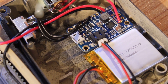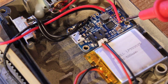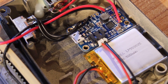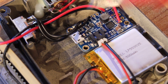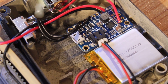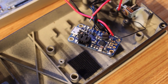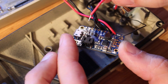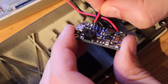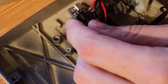We made a slight mistake — not unexpected. I hooked the barrel jack up to the plus pin over here because this is a header for USB, and I thought this was the USB in to charge it. But nope, that's the USB power out. The USB in to charge it is the micro USB on the left side, which makes it a lot harder to solder in an external solder point. Actually, it's easier than I was expecting — I ran over to the computer and double-checked on Adafruit's website. There's an extra pin here called USB that's directly connected up to the 5 volts coming from USB power. So instead of plugging into the micro USB, we can just run the 5 volts directly into that pin, and I'm going to go ahead and solder that up.